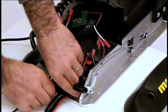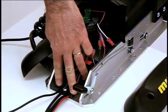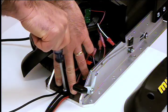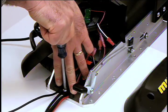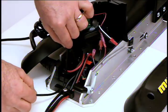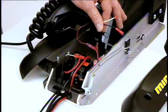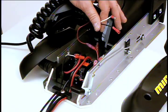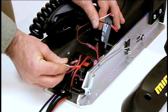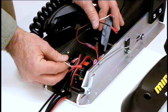Position the iPilot steering cable into the open slot. Then tighten the cable strain relief. The cable should slide freely when properly installed. Locate the black and white wires coming through the center housing. Now find the black and white wires coming from the iPilot steering cable — this is the cable that we just routed through the strain relief.